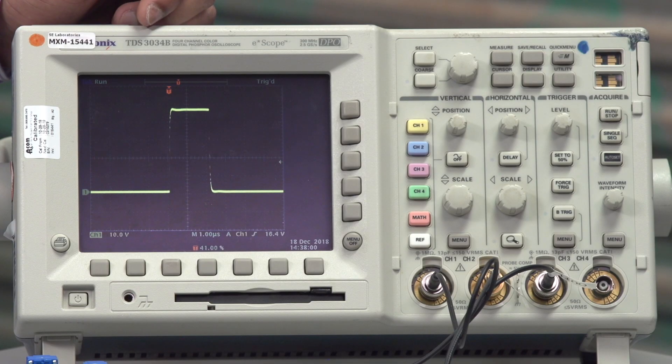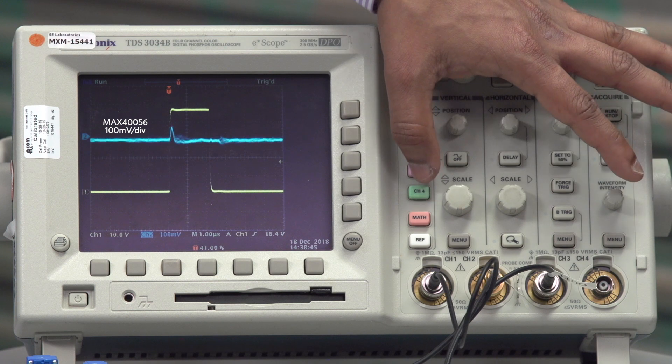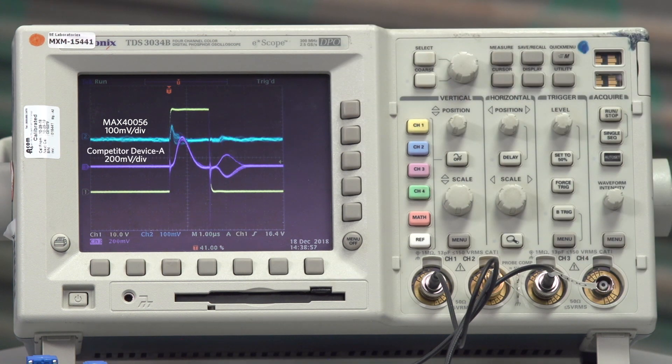As you can see, the yellow trace is the output of the PWM generator. It generates 0 to 48-volt pulses. The board is set up to provide a 500 volt per microsecond slew rate. Ideally, for the given common mode pulses, an ideal current sense amplifier should not provide any disturbance at the output because it is a common mode signal. Now let us look at the output of each of the devices. As you can see, the output of MAX456 — the amplitude glitches at the PWM edges are less than 100 millivolts — and you can see that the outputs settle faster, which makes it more responsive. Comparing it with the competing device, you can see that the amplitudes are way larger.